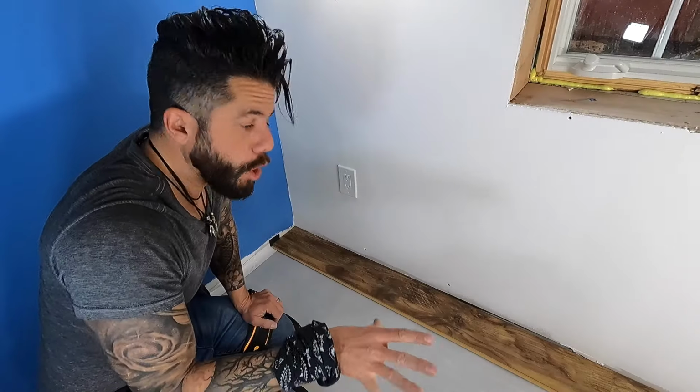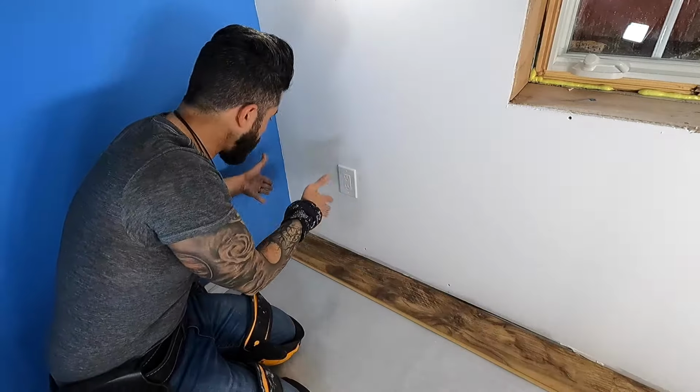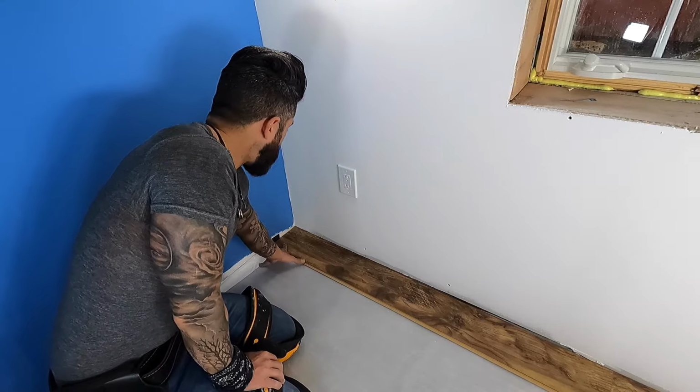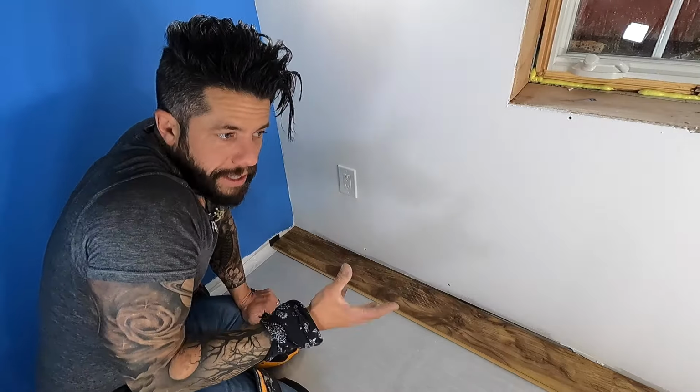All right, so we're about to start our second row. A couple things I want to mention really quick. When you cut the last piece in your first row, the scrap usually you can bring over and start your next row with, as long as it fits into these rules. The piece can't be any less than 8 inches, and the seams can't be any less than 12 inches apart. So normally you're able to do that technique.